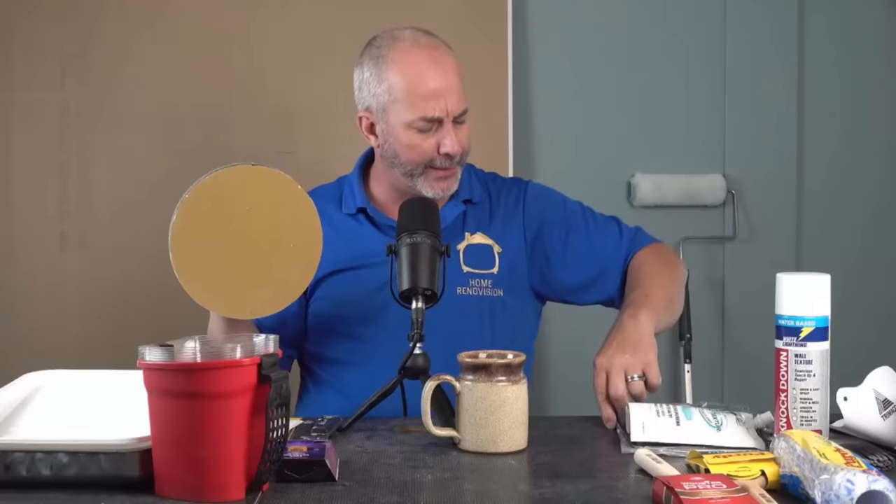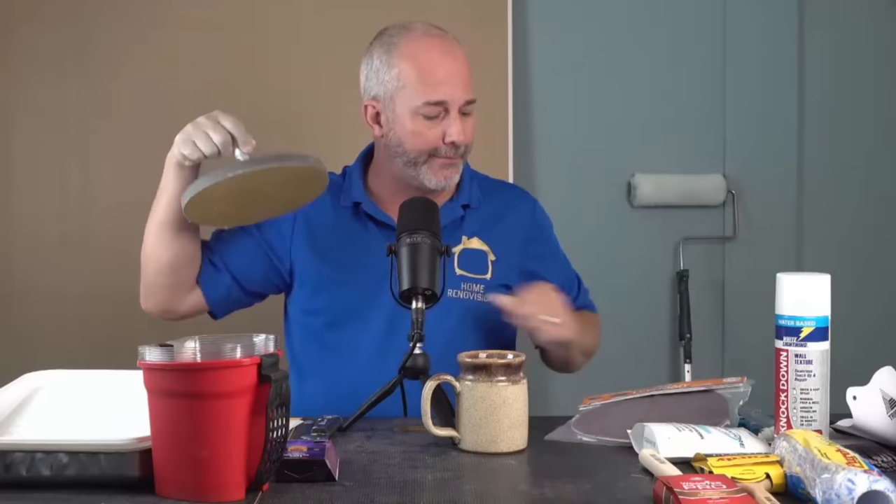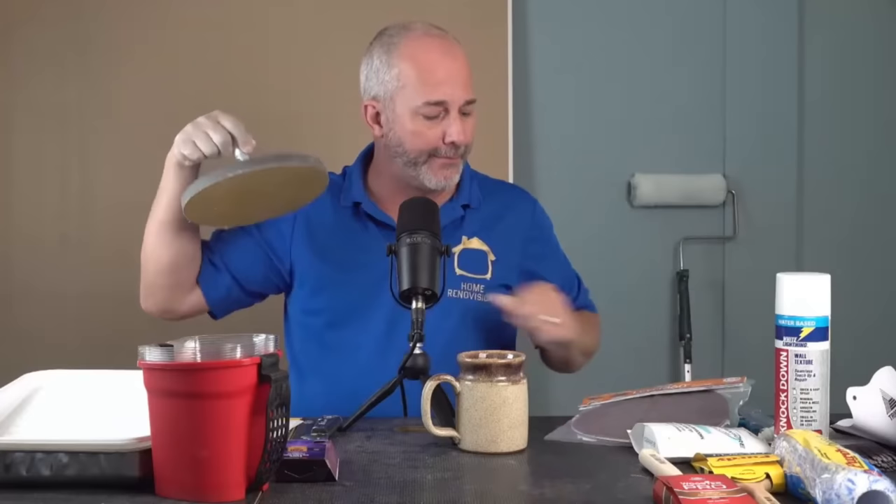One more thing — these radial sanders. There are a couple of companies I like. One is Level 360, and this one here is Hyde — a very basic version. Level 360 is more complicated with different options where you can swap out different heads and finishes. They make great pads and they're all interchangeable — all hook and loop, all nine inch. So if you run out of sanding discs, don't worry about the supplier — they're interchangeable, just get what you need.